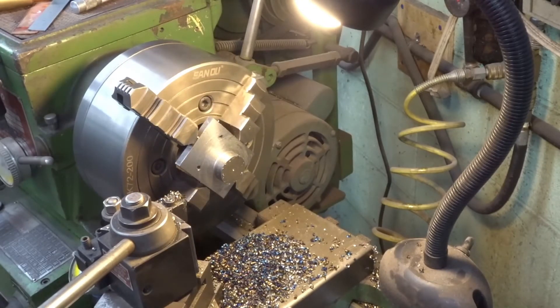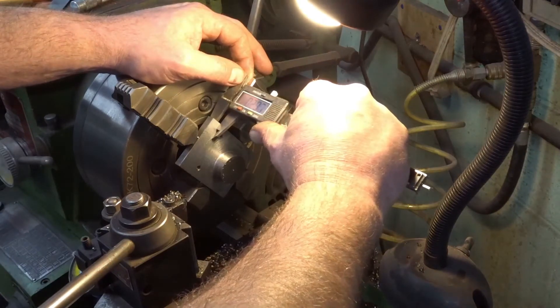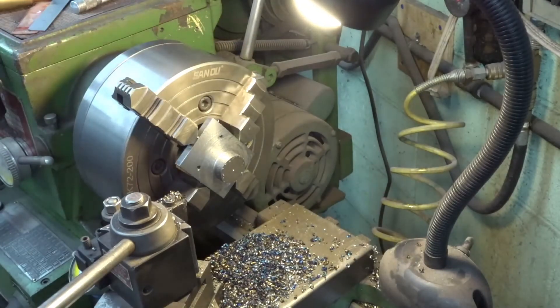Okay, we should be down to our final cut. It should be 0.25 inches and we're at 0.297 to 0.299 — right around three. It's pretty warm too so we'll take maybe half of it.